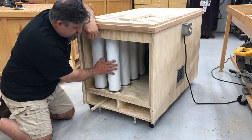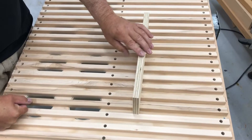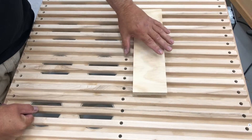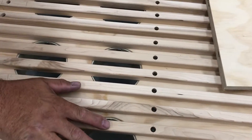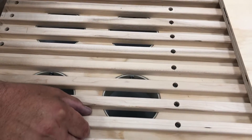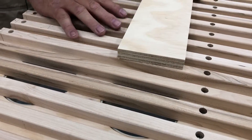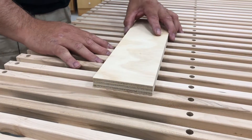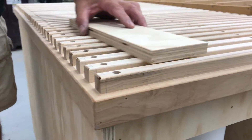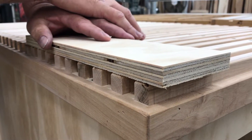I've got these full filter kits available on my website. This table is made from three sheets of three-quarter inch plywood — I'm using sanded AC plywood for the bulk of it. There are 14 filter openings, and those filter holes are covered by three-quarter by three-quarter hard maple slats to keep your workpiece up above and allow air to flow underneath it. The fronts of these channels are also open, so even if you cover the entire table with a sheet of plywood you'll still have airflow in the front that will be drawn back to the fan.